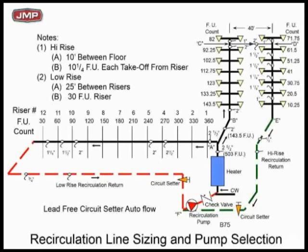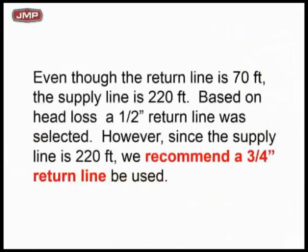You've got to put circuit setters, you've got to put flow limiters — you have to do some balancing. In fact, you may have to upsize your circulator a little bit to make sure you've got enough flow to balance. A circuit setter at half-inch and 0.25 GPM is impossible to read, so you've got to keep that in mind.